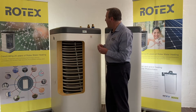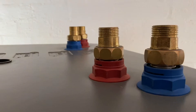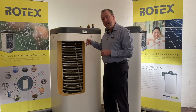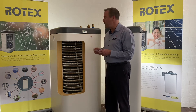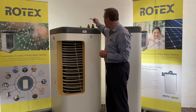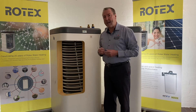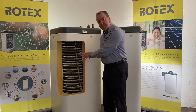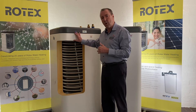The tank itself can come in various configurations. This example we've got here shows a dual coil set — two coil sets, one inside the outer coil casing, which can either be a provision for a greater flow rate, maybe in a commercial facility that requires lots of hot water in a short period of time, or alternatively, in a residential facility whereby one coil set might be related to domestic hot water supply and the other coil set could be for hydronic heating purposes. So in a very confined footprint, multiple energy sources can come into our thermal battery, which can be located internally or externally.